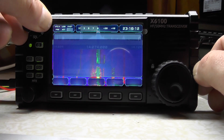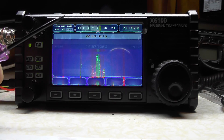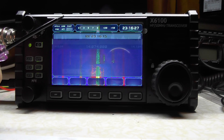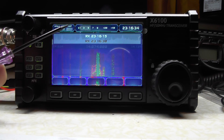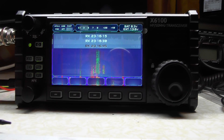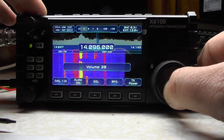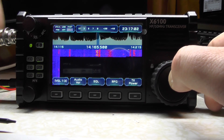We'll attempt to decode some FT8 — press app and then FT8. There we go, we should start seeing messages appear on the screen now. It worked earlier with no real problems. I'm not able to get anything coming through right now, maybe because the time was wrong on the radio — they do say when you do FT8 the time has to be correct. Let's see if any messages appear in RX. We're not actually decoding any FT8 data, but if I press general and select the band we should hear some activity.